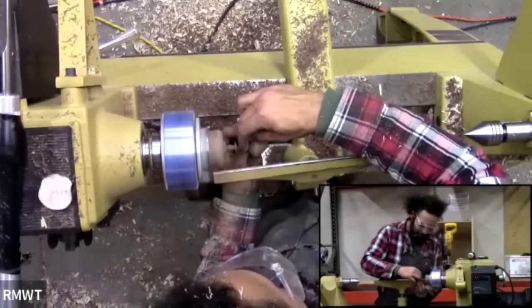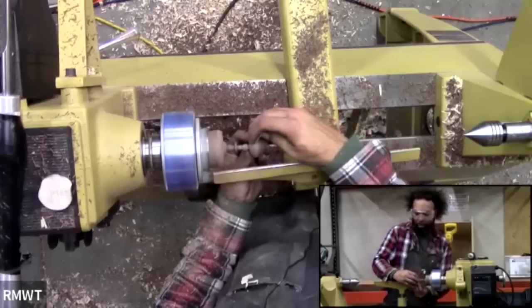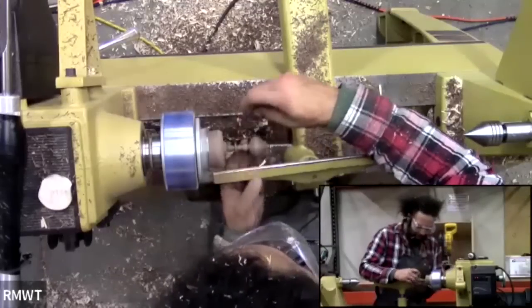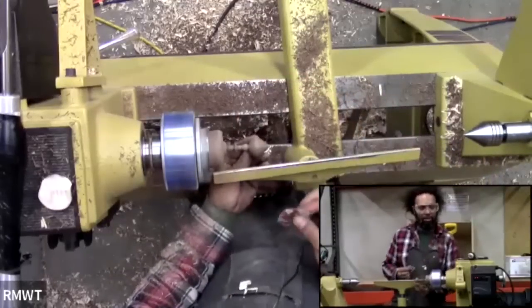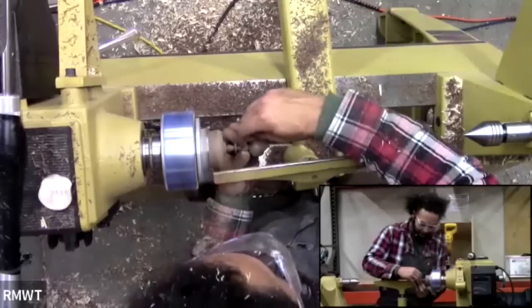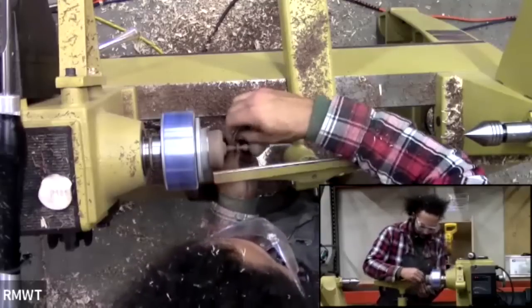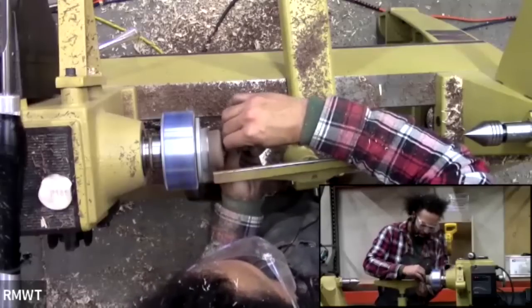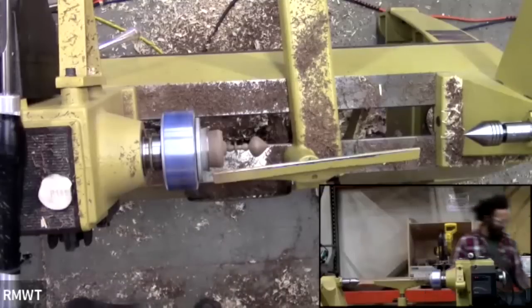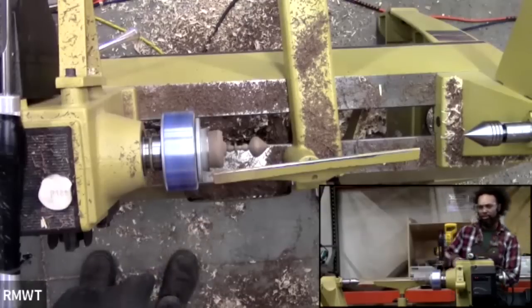So sanding, again, is not one of those things that everybody loves. I would say that the cleaner you cut, the more friendly you're becoming with the sanding process, because what you're doing is very much like in furniture. Sanding is something that's very much a part of the burnishing and finishing process. You want to think of using turning tools the same way, where you're basically creating something very clean and nice straight off a tool, to then, if at all, with any kind of finish, just apply a little bit of sandpaper and think of it more as the finishing process than something that you have to arduously go through that you hate. Now, you can arduously hate it if there's a lot of tear out. So consider that practice, not necessarily something that you want to finish.